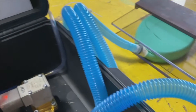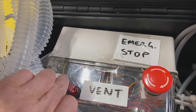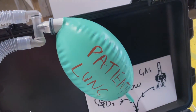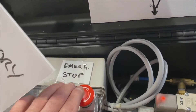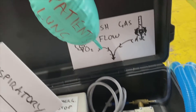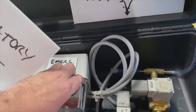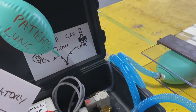I'm just going to flick it back on to ventilate to show you one other feature. If you're ventilating and all of a sudden you want to suddenly stop for whatever reason, you hit emergency stop and that immediately shuts down the system — all the valves close and the system stops ventilating. So for example, if you were disconnecting your circuit from the patient and you didn't want gases being blown, it's very easily set — just switch it back on and the system sets up again.